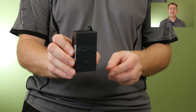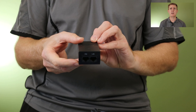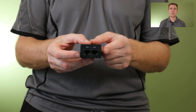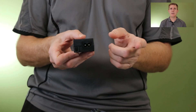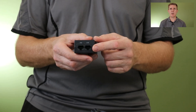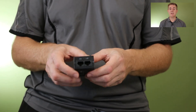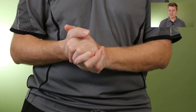You're going to get a 24-volt POE injector. Remember, this is 24 volts — a lot of outside equipment is 24 volts. This won't run off a normal POE switch because those are 48 volts, so you want to make sure you use this inline. Mains comes in one side, data from your router comes in the other side, and then a cable runs out to the actual device itself with the power and data mixed together.